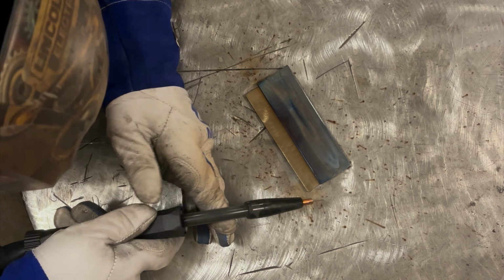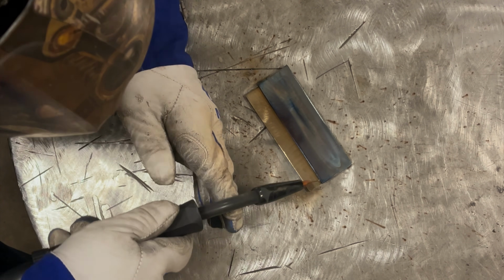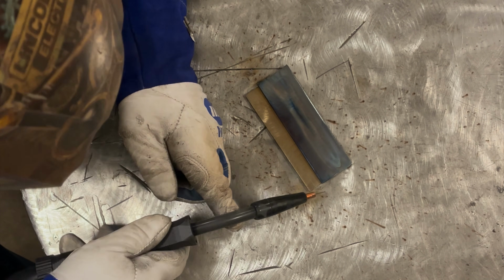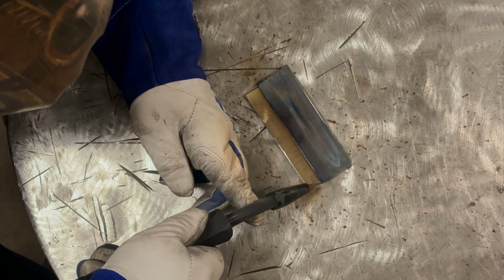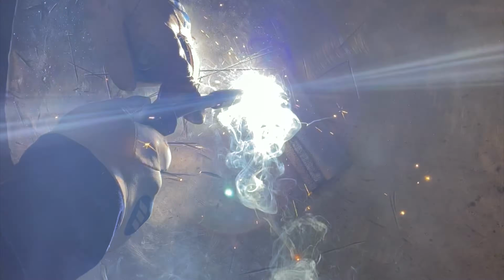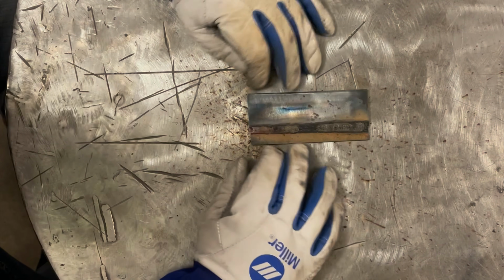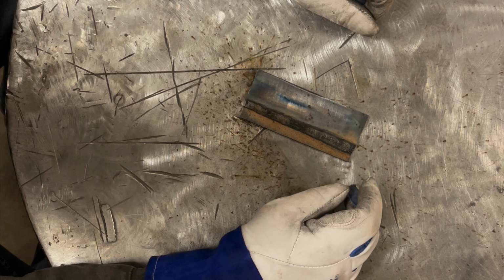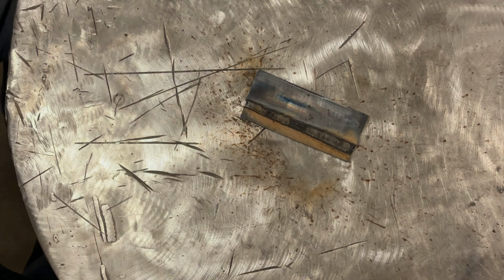All right, that's at least cool enough to weld. Let me run another weld on this. And actually this one, I'm going to lay flatter. Well, I guess I'm just going to do it at 45. Another good run, same deal as before. You can see all the indicators that odds are what's underneath there is going to look pretty decent. We'll let that cool off, clean it.